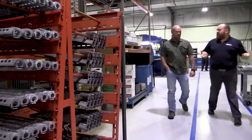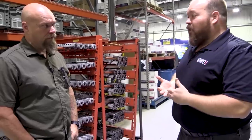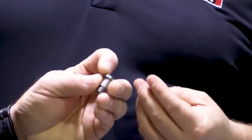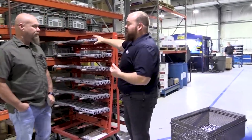This is deburring finishing. This is where we put a lot of the hand touches and final touches on the products that make them look really great and function right. We cannot have burrs on anything that's mechanical — every piece here gets touched in some way. Here's a bipod pivot screw — these come from the machine with a few sharp edges, but not bad. They'll go in this automated blaster where they'll be shot peened and blasted and prepared to be parkerized. And then a larger part — it ranges everything from a really small part like this to an upper receiver for an M107.